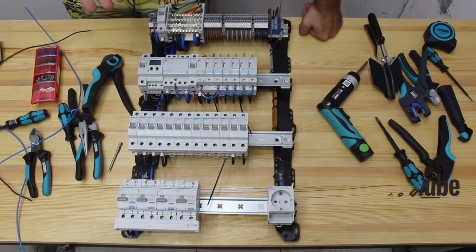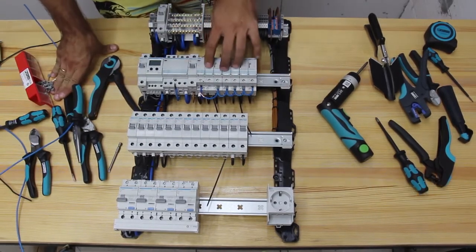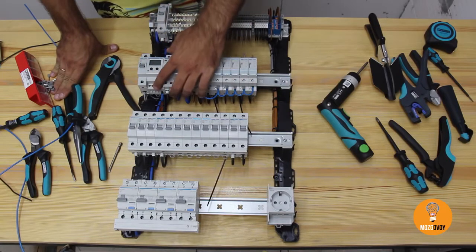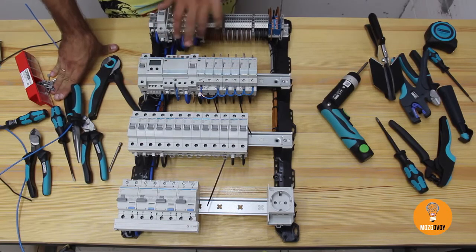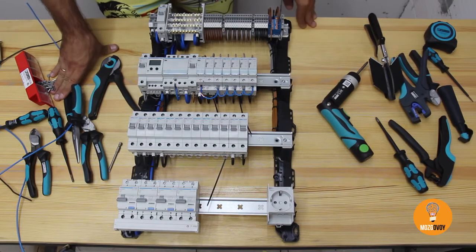If you also enjoy the result, don't forget to hit the like button. All that's left is to connect the neutral to the impulse relay — neutral comes from the interruptible line. Also on the voltage relay, direct live connects to the sixth clamp coming from the PDB, and the output is wired to the A1 clamp of the contactor. The power socket is connected and grounded; neutral comes from the PDB uninterruptible power line, and live wire naturally also comes from there.